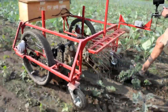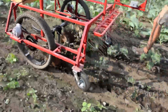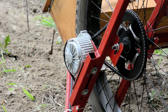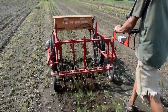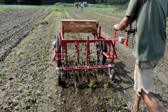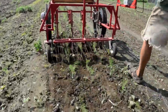The frame is built of standard 1-inch 16-gauge square tubing. The wheels are made from doubled-up bicycle rims to carry two tires for more traction and flotation. The scooter motor has a modified cog to increase the gear reduction to the wheels. The cost of a Weed Weasel is about $1,400 in materials and 40 hours of labor. Building one requires metal fabrication, bicycle mechanics, electrical wiring, and a little basic carpentry. Small shops and maker spaces are well equipped to make this an easy project. Full step-by-step plans are available for free at farmhack.net.